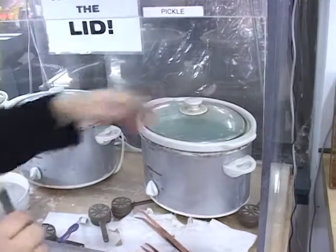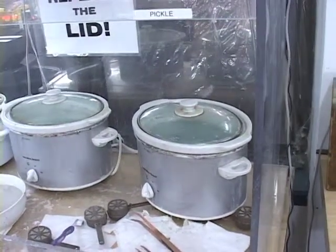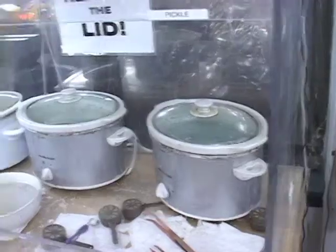After you solder, you always need to pickle. It's going to clean up the oxides and all of the extra flux. Leave it in there for, I would say, 3 to 5 minutes until it's nice and clean. We'll take it out, we'll rinse it off, and then we'll start hammering.